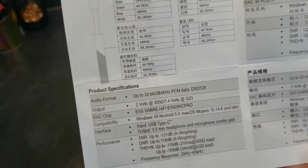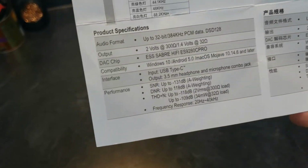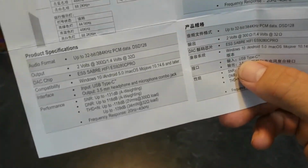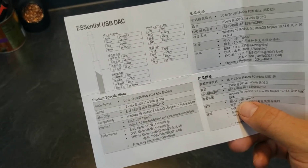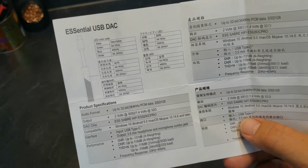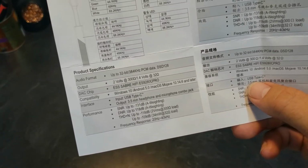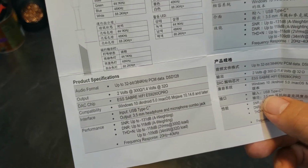And then the other thing with a lot of 24-bit audio is that a lot of it is not real 24-bit. A lot of it is, especially older rock and roll like Pink Floyd or the Beatles, whatever. They're taking analog tape recordings, and even the best tape back then had maybe 70, 80 dB dynamic range. The frequency response, I still don't think, reached 20 kilohertz. It might have been around 16 to 18 kilohertz, even on the best tape back then.